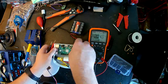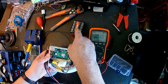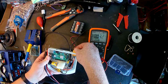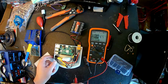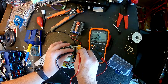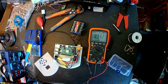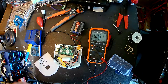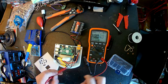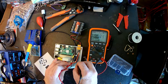We're going to take a multimeter and make sure that our LM2596 is going to reduce the power correctly. We're going to check all the wiring before we plug in any power to our device so that we don't fry anything. I'm using a 12-volt battery — we're going to test the battery first. Looks like 12.71 volts, that's good. Now I'm going to test the input of the step-down voltage chip to make sure it's also 12.71 volts. We've got it in the off position, so we're going to switch it on.